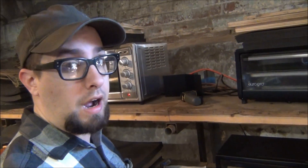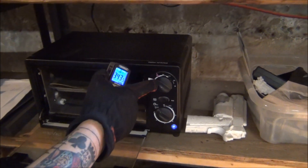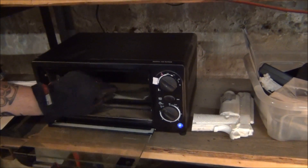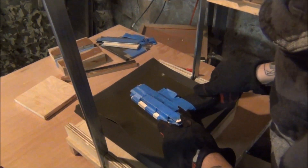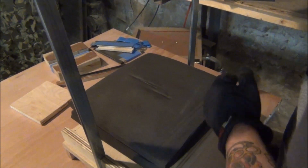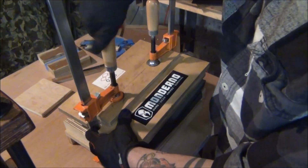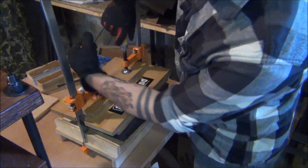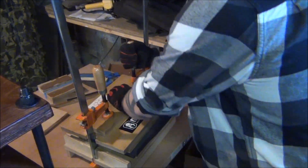The key to a consistent mold every time is applying consistent temperature and consistent pressure to the Kydex. We use non-contact thermometers to accurately measure the temperature of the material, because the oven dial is a liar — it's not even reading 300 degrees yet but the actual material temperature is closer to mid-300s. We pop it out of the oven, bring it to the press, get it lined up, put the top piece of foam on — and we leave the foam on top of the oven so it's already warm, giving us more working time and better definition. Then we crank it down and give it a couple minutes to cool.